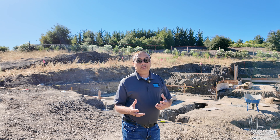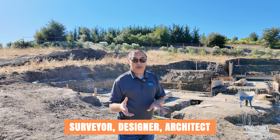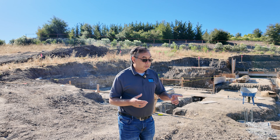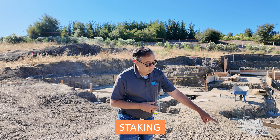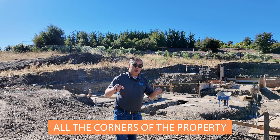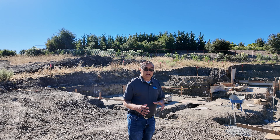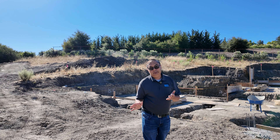When you start a foundation for a home like this, first thing we do is get the surveyor involved. Typically a survey is done before the plans are made, then the home is situated on that site plan developed by both the surveyor and our designer or architect. You place the home there, get the permits, and once we start construction we bring back the surveyor. They do what's called staking — they mark all these points. All these sticks with flags tell us the elevation of each one, giving us an idea how much soil to cut or fill.